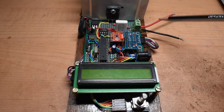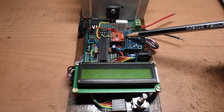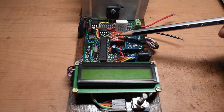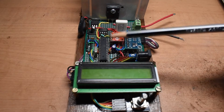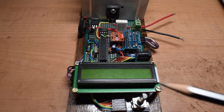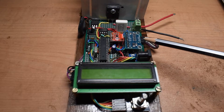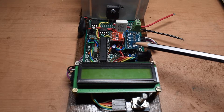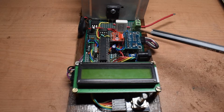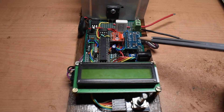The third change is using a DAC converter — the MCP4725 — which is a dedicated I2C DAC with 12-bit resolution. I assume it will do a much better job than the Arduino's internal 8-bit DAC. In my previous breadboard testing video I used a 16-bit I2C ADC and got quite good results, so I expect a fair amount of accuracy with this circuit as well.